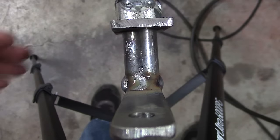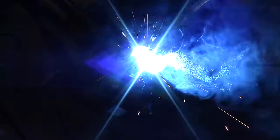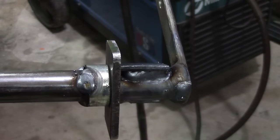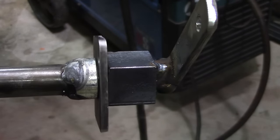As you can see, the column pivots very well. The steering stop — that's what prevents you from oversteering — needs to have a little bit of play so that the lower bracket can rotate freely. Notice it rotates freely and has a little bit of playroom. That's exactly what you're looking for. You do not want this to bind.